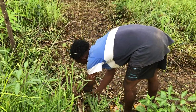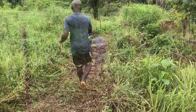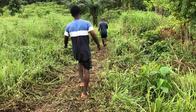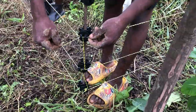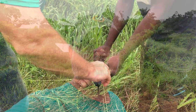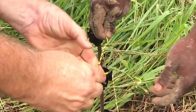We put four wires up. Hopefully after a few weeks or a month we'll reduce it to three wires, and eventually possibly two, but I'm a little worried about my dogs getting through and attacking the sheep, so we'll probably stick with three wires. We ended up stringing four rows of wire using a little over 800 feet of wire. The first roll ran out at around 650 feet, so we had to splice the two wires together — fortunately I had bought a splicer for exactly that purpose and it worked as designed.